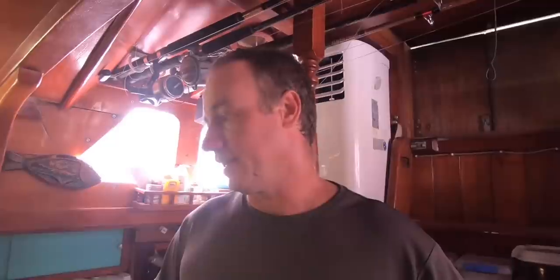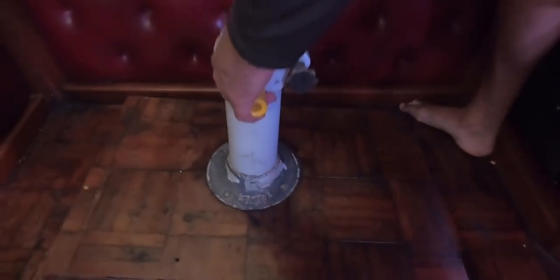We've got so much to do, but our plan is to get going in three weeks, so time's ticking. Our batteries are about four or five years old, and we didn't want to cross the Indian Ocean with batteries that could potentially fail. So we've ordered new batteries — I picked them up yesterday. There's 750 amp-hours of batteries, replacing our original bank which was 660 amp-hours.